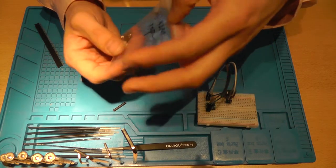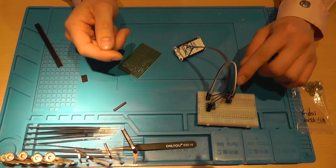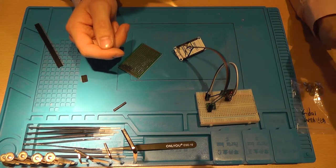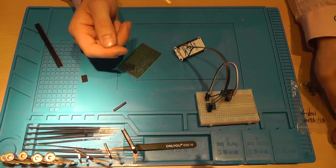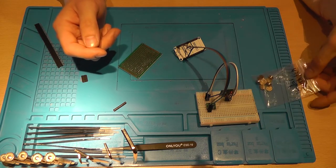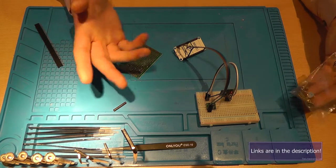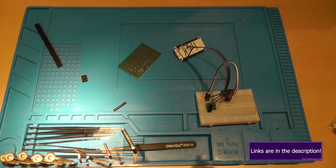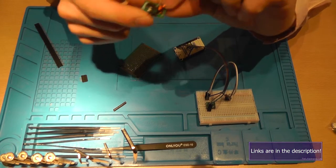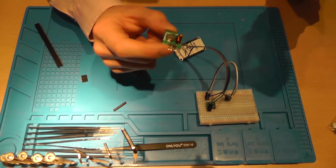433.42 megahertz crystal oscillators. Now, the ones on the transmitter are 432.92 megahertz, if I'm correct, or 96, not sure. But that's not the right frequency for the Somfy sunscreens. So you need to buy a bag of 433.42 megahertz crystal oscillators on eBay, AliExpress, wherever you can get them. And you need to replace the existing crystal of this radio transmitter module. It should fit right into it.